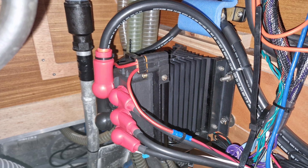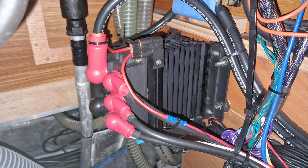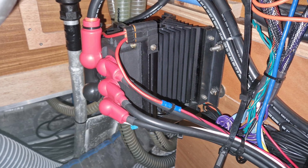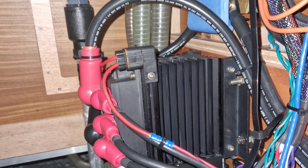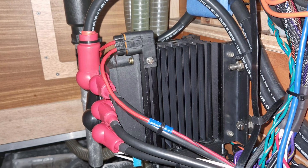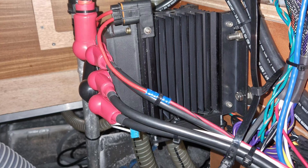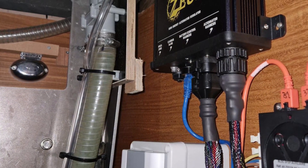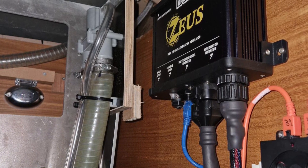Here is where Tom's installed the remote rectifier in the little space above the gearbox of the engine — it's called the engine room. We can see the loom that comes as part of the regulator that Tom's also installed. You'll see the three AC wires, and then behind those the two DC cables that carry power to the bus bars. Lots of cabling — Tom's done a great job.